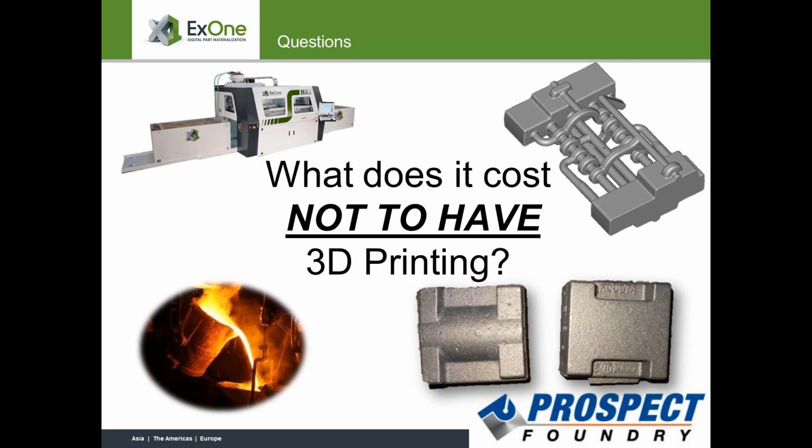after time. Because once you create that model, ExOne doesn't have a problem with the repeatability of their process. But the fact is, there's a million jobs out there at different foundries that were made before 3D modeling was used, and they were done the old-fashioned way by machining out the shell box. So it has to be done properly, and that's one of the obstacles of getting printing done. But I can see that definitely this could be used on a lot of different stuff for the foundry, for valves especially, on legacy jobs that have been around for quite a while.